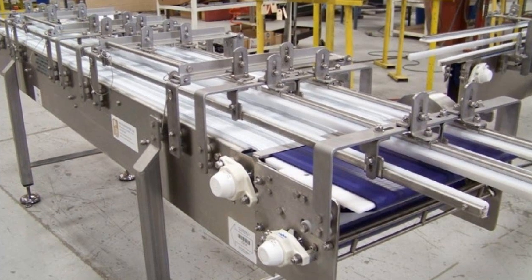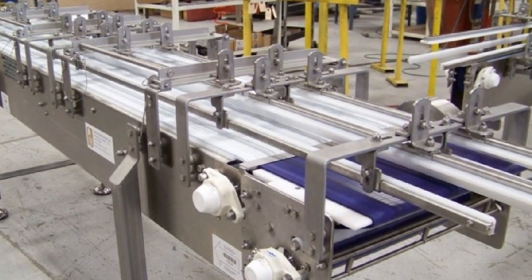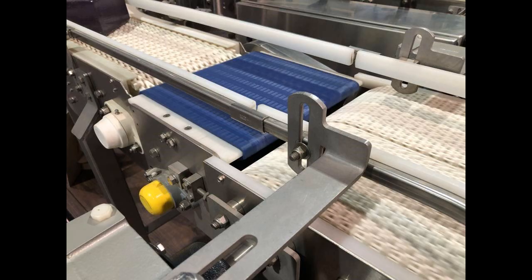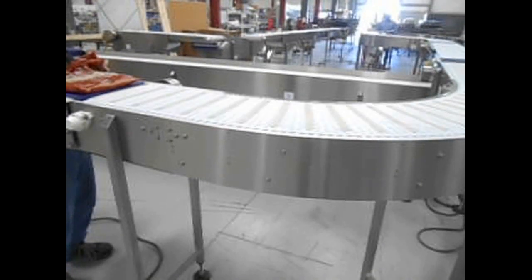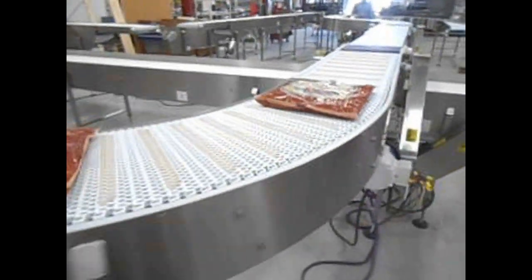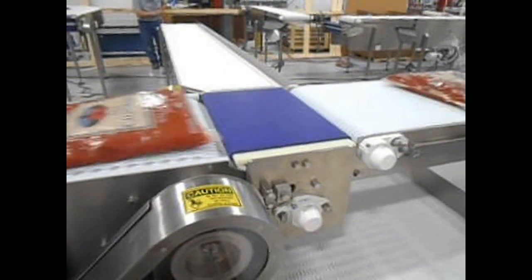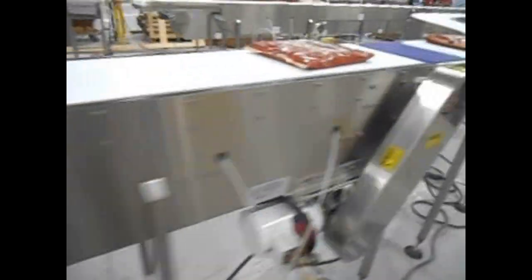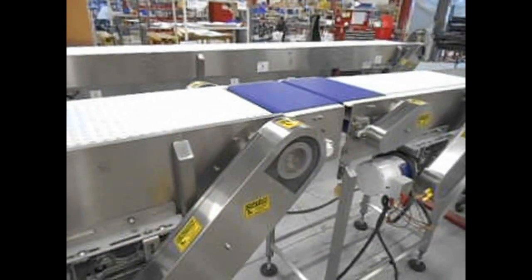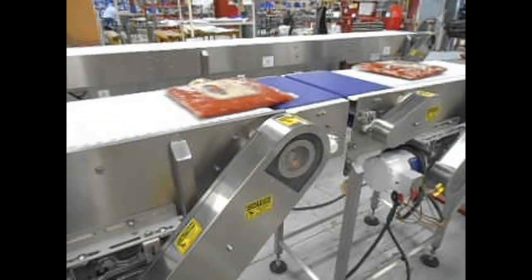And here, the micro-pitch transfer is beneath an overhead hold-down rail with locking pin. The most effective way of incorporating this technology is by pre-planning the use of the micro-pitch in the original conveyor design. An afterthought approach is far more costly and may require line extensions or add-ons. This transfer technology may be difficult to retrofit to original designs if incompatible belt widths were used or transfer space is insufficient.